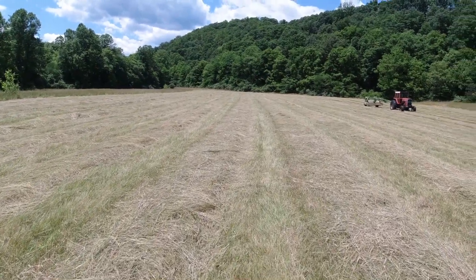That right there is a fine combo. Those two were made for each other — the '77 Massey Ferguson 1105 and the Krone 2801 CV. It's right at a nine-foot cut. It's a disc mower with impeller tine conditioners. The impeller tines do a great job of conditioning the grass and stems, especially when we cut hay. The dry down is unbelievable.